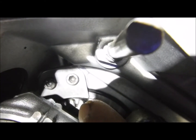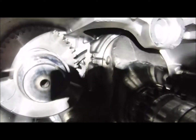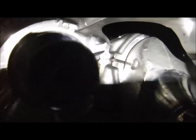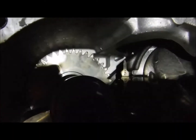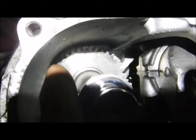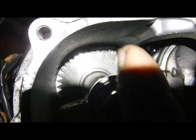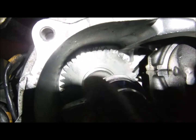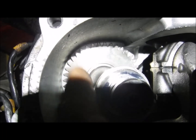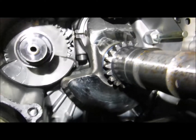Opposite me down, line this up — you can see that timing mark, a little zero, right about there. That's going to be on the opposite side over here. Forgive me for the lighting here, but you'll get the idea. Then those two timing marks — you rotate the crankshaft, and when those marks line up and you push this back into its hole on the underside, the balance shaft and those two will be timed up. Then you have to do your crankshaft timing, which is what I just explained.